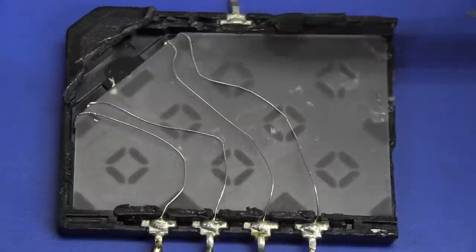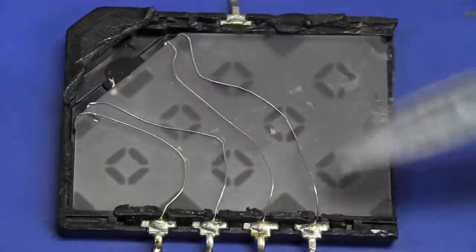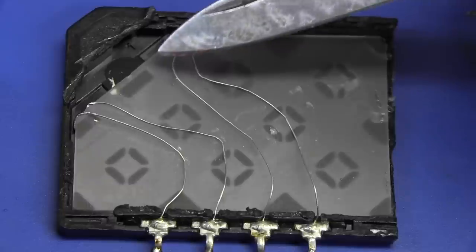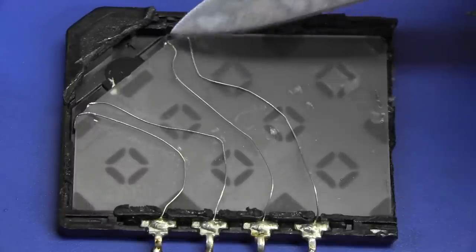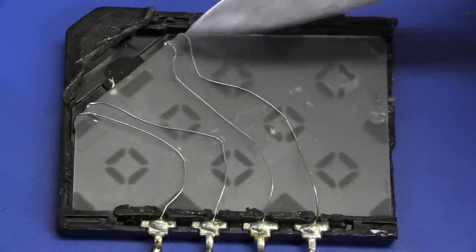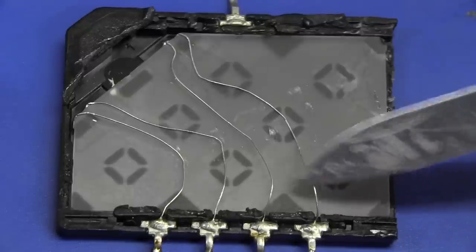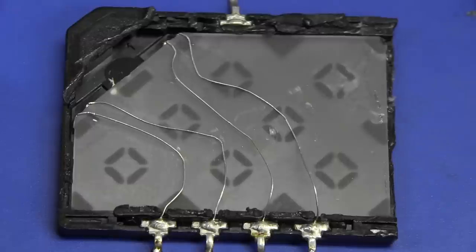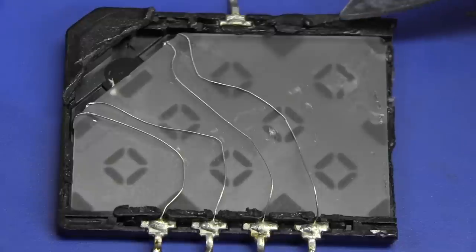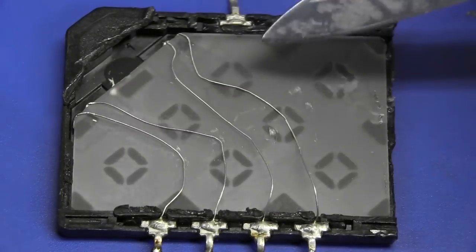You shouldn't get too many end-to-end reflections — i.e., if this is the transmitter, you shouldn't get it going all the way through and then bouncing back off the transducer end — because A, it's terminated properly, and B, because the transducer is physically glued or soldered onto that edge, you've affected the properties of that edge. It's not going to reflect nearly as much magnitude as when bouncing off the nice smooth edges within other aspects of the device. It would actually be fascinating if we had suitable transducers to attach at the various reflection points — we'd actually be able to see all of the multiple delays.